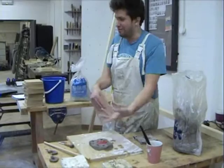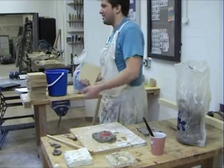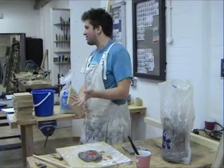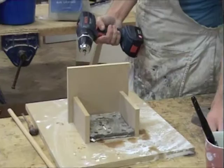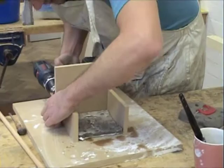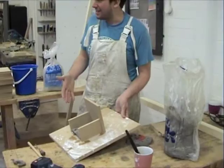You can pretty much use anything — you just want to build a wall around this bit of clay. Whether it's a rough bit of metal that you can gaffer tape together, or some wood that you screw together, you sort of make a little casing for it. We're just trying to build a wall, so we don't need to make it perfect because it's just going to get covered in plaster. You just get it together so you completely encase the clay.